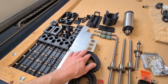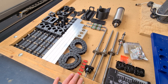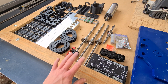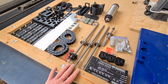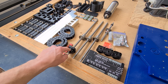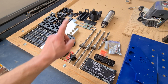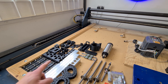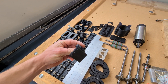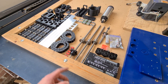We've got the standard ball screw blocks, standard drag chain, and some end stops — as this is a budget build I wanted to use standard end stop switches rather than inductive sensors. Ball screws — I forgot the exact lengths but they'll be in the BOM — and matching bearing blocks. These are becoming increasingly difficult to find, and they're the slightly smaller variants than the ones used on the big machine. To save costs we haven't gone for the floating side bearing blocks; instead we've got our own 3D printed blocks that hold the floating side bearing. They're only there to stop the ball screw from whipping around so we can make our own.